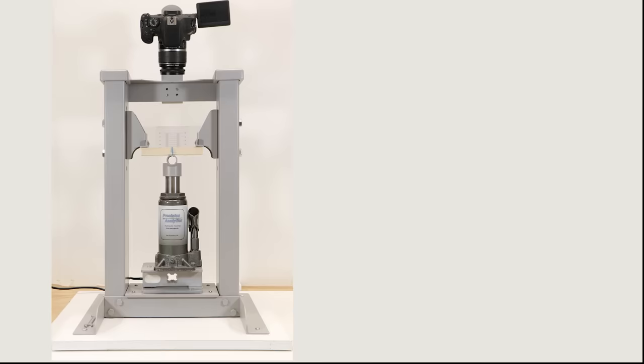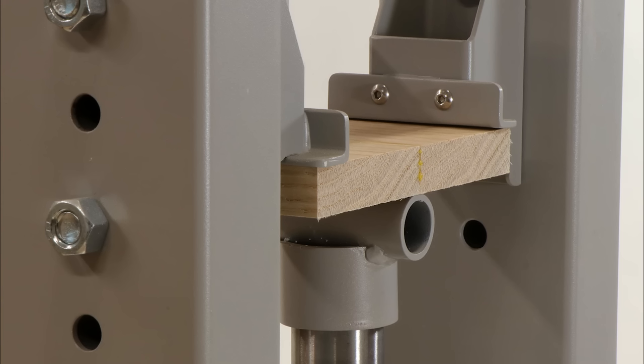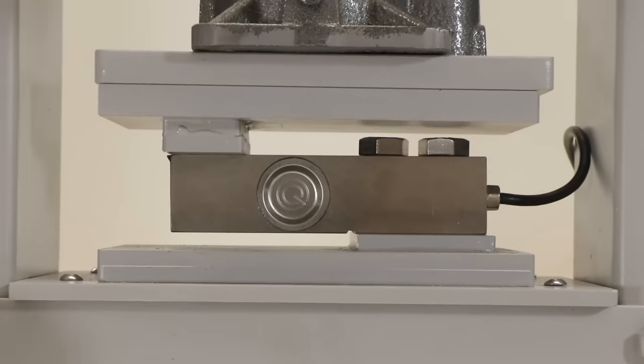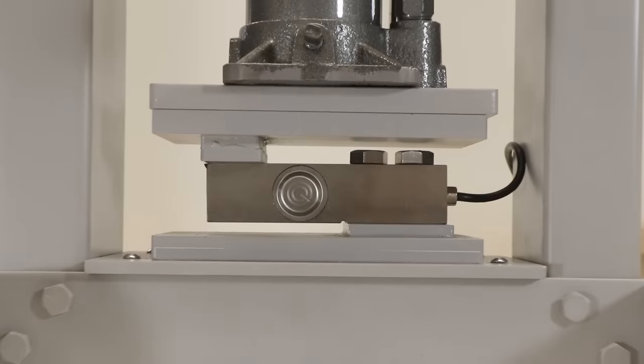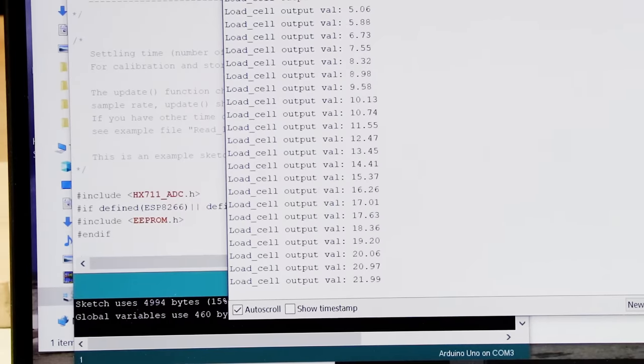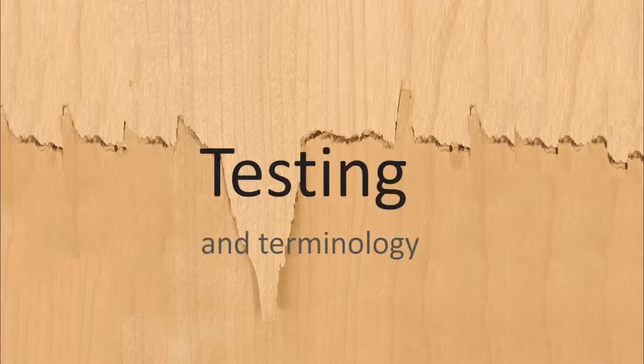When the joints are fully cured, we will stress them in a hydraulic press specifically designed for this kind of test. Wood needs time to bend and adjust to loads, and this setup lets us go at whatever speed the wood needs — it also lets us see the breakage as it occurs. The force applied is measured directly with an electronic load cell sitting under the hydraulic pump. Load cells are the definitive method used in scientific labs, and results record on a computer at 10 times per second to detect transient peak loads. Note that this is not recording pressure like a hydraulic fluid gauge — the load cell reflects the total force on the wood piece.